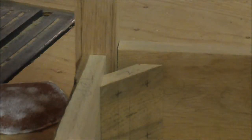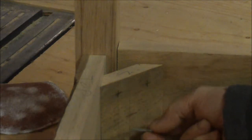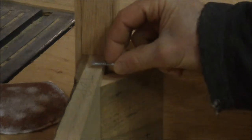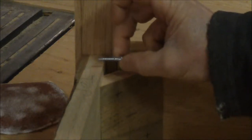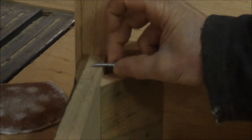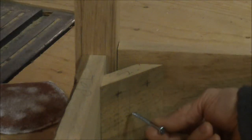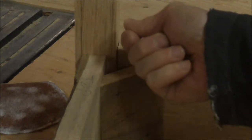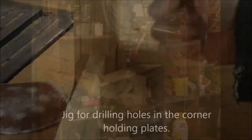I've got 1-inch number 8 screws that are gonna go here and here, and they're gonna hold that little board to the sideboards and the front boards and back boards. And then got number 10 2-inch screws that are going to go in the middle here. They're going to pull the leg into the sideboards, making that joint very stiff and tight.